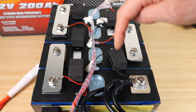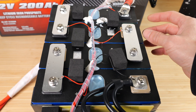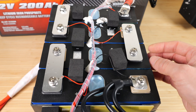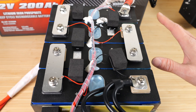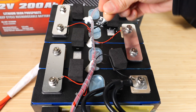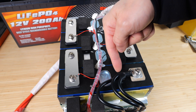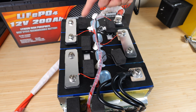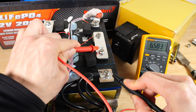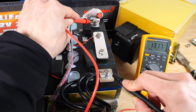The balancing is to make sure all cells are at equal voltage. If one is even a little bit off, it will take some current from the higher voltage cell and put it into the lower voltage cell, thereby equalizing everything. The temperature sensor is right here — they've used caulk material everywhere to hold it in place. The serial number of each cell is labeled on each one, and they flip them around. Starting with the first cell: 3.3 volts, 6.6 volts, 9.9 volts, and finally the full 13.2 volts.